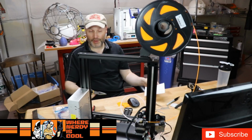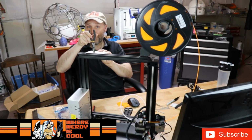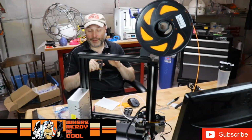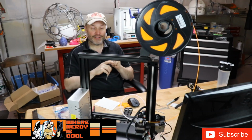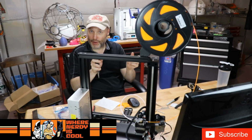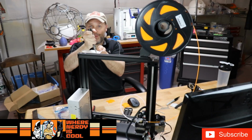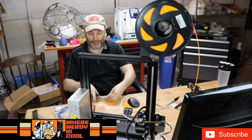Did all four corners this way, went to the center, and noticed that it was kind of above. So leaving the print head in the center, I went to each knob and gave them a small turn each, and noticed that suddenly it was way in the center. So slowly back them off, and now the center seems happy. So we shall see.